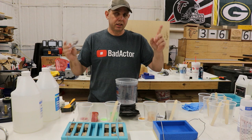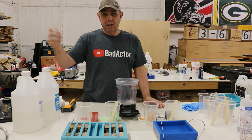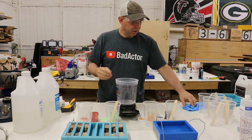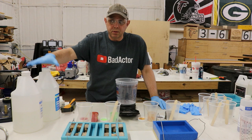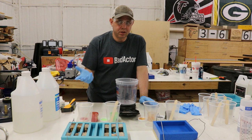Alumilite has 12 minutes of working time. You want to pour it at a certain temperature — I did a swirling video on that, link below. Alumilite is one to one by weight, not volume. If you do it by volume, you're going to be horribly wrong. The other resin we're going to go by volume and won't need scales, but Alumilite we scale out. I want around 40 ounces total, so about 20 ounces per part. Safety first — glasses and gloves.